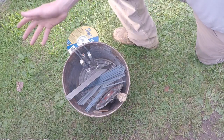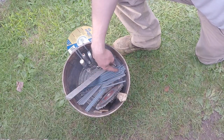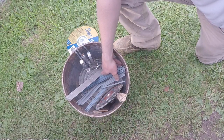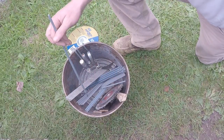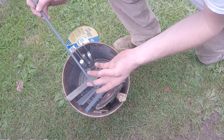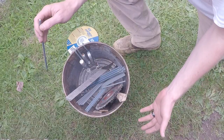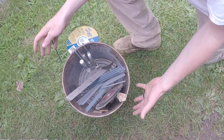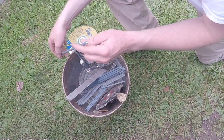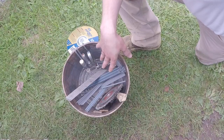We can use this job for instance — we're on 42-inch 740 wall, so we're definitely gonna need more than this many 3/16ths welding rods. It's gonna take way more than this, but I just wanted to give you guys an example. First things first, get to know your welding rod sizes. I put the bare ends down so that if the bottom of the rod bucket is wet, or you're down in a bell hole or a muddy area and you set your bucket down, if your rods get wet it'll only be on the bare end where it won't affect where the welder strikes up.